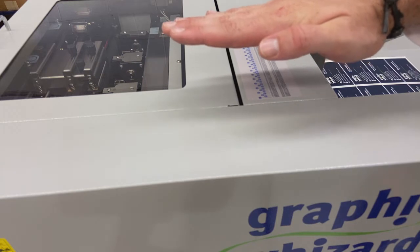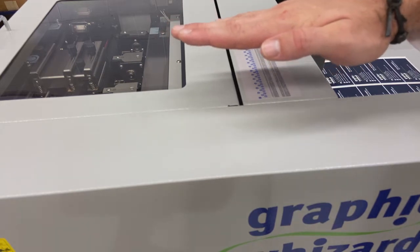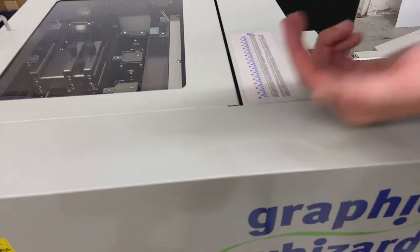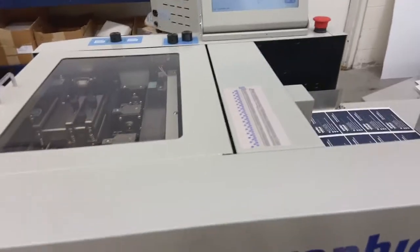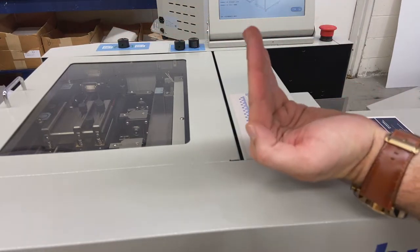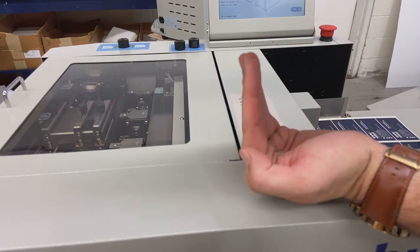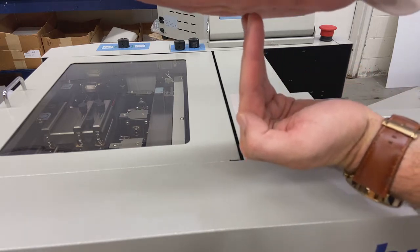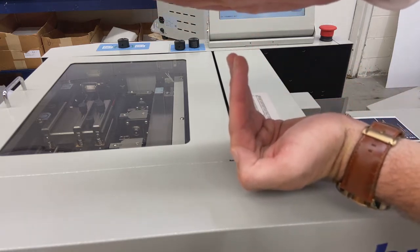Next, beside this one, my feeding belt itself, like I said, the suction belt sits horizontal inside the machine. We can just see it from the front. And we want that to pull through one sheet at a time. So the second adjustment here, or a set of fingers, as you can see my hand demonstration here. And as I tighten that up, so turning it clockwise, it gets smaller. You can see there's a little diagram on there, and it makes that gap smaller. Okay? And then when I open it up, it makes that bigger.